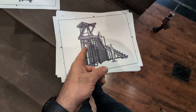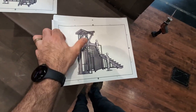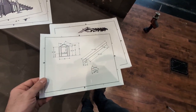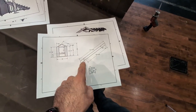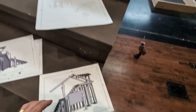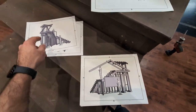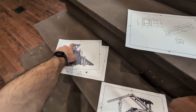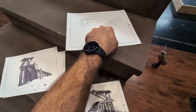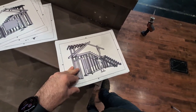I worked out a way then to leave ourselves enough inside corner in this area of the window so that it can work for us and stay central to that wall. And the dormer window is a little bit narrower, but they're on the same center line, which should ultimately look the way that we needed it to. I've brought my dimensions to build the dormer: the framing for the gable end of the dormer, a dormer rafter, and the full-size rafter, which will be everything to get us to this point. And then we can start looking at what that means.